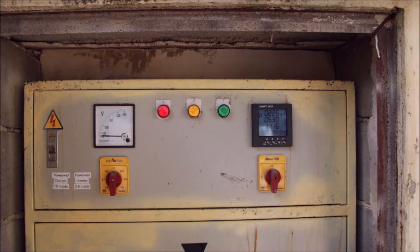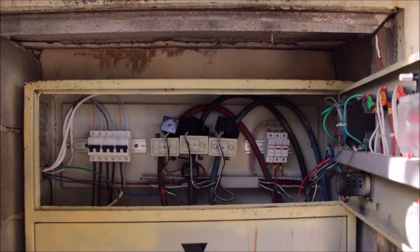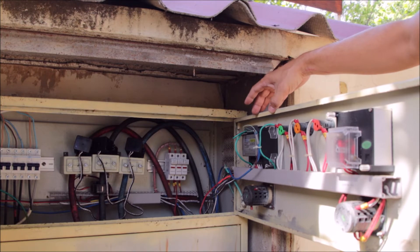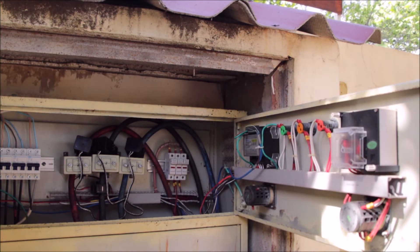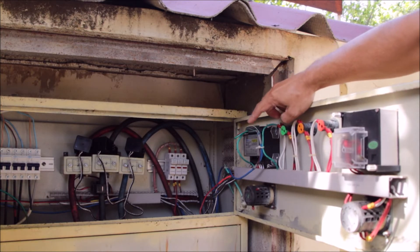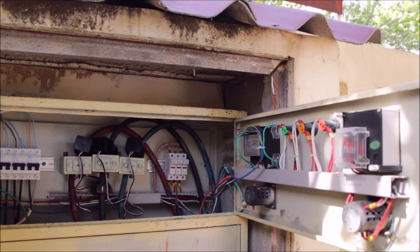The design of this meter is a so-called panel meter, so it is installed into something like this — a metallic box which is a main distribution box. From the back, it is placed into a cutout of around 10 by 10 centimeters. We have current transformers which you can choose however you need them for your installation. I have pretty big ones here because these are substantial supply cables. There are also three fast-blowing fuses protecting each phase going through the meter.